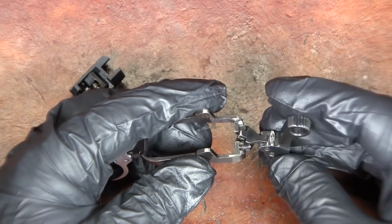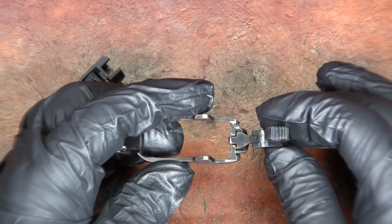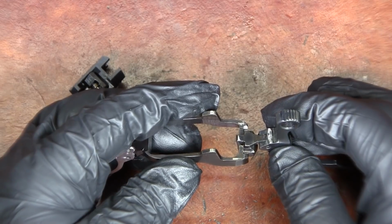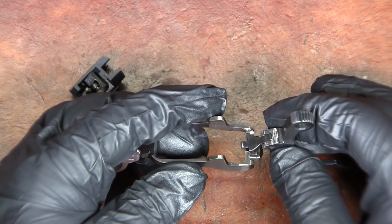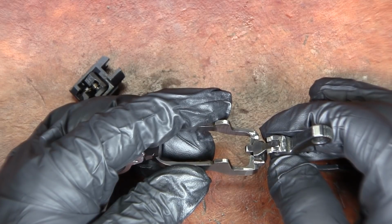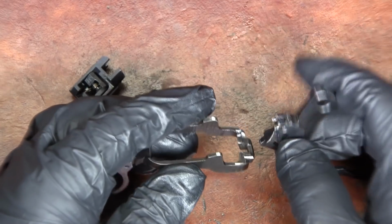The disconnector is pressed up against those ledges of the trigger bar. As the trigger bar pushes the disconnector back, it cocks the hammer. So what lets off the double action trigger pull?